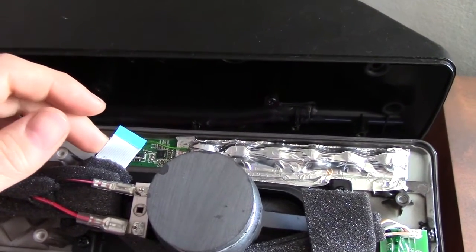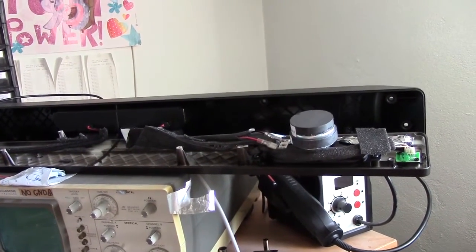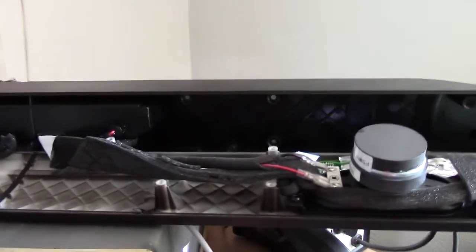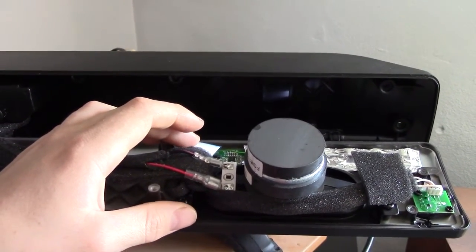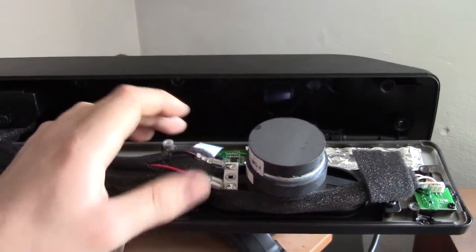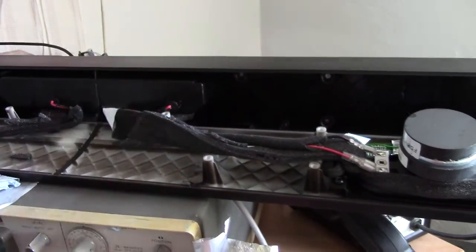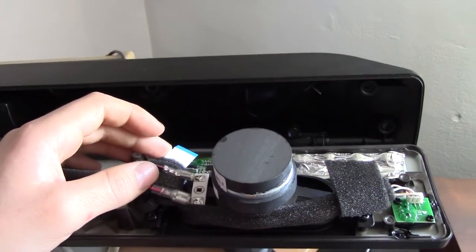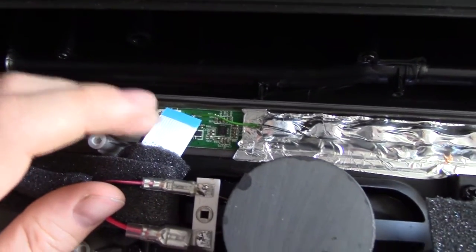What we have done now, since the modification of the front panel didn't work, is I've turned the unit on and disconnected the front panel after it's turned on. I set the correct source and volume, and indeed it went playing for about 15 hours now with no issues. So this pretty much rules out anything but an issue on this board, since if there was an issue with the communication between the boards, you would think that the main board would still be acting up whether or not this board is connected, but it obviously isn't. It could still be something like that, but I'm reasonably certain that there's something wonky with this board.